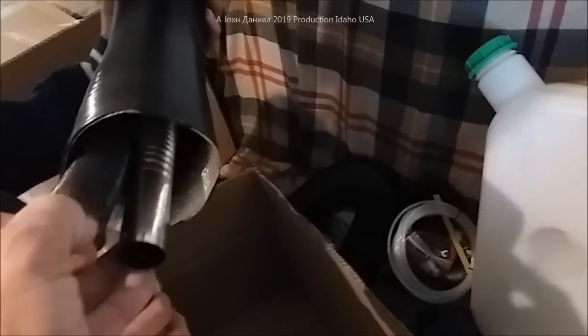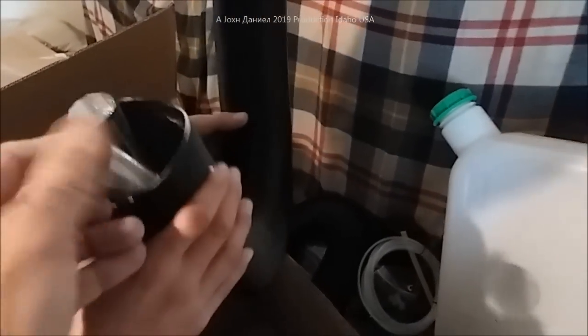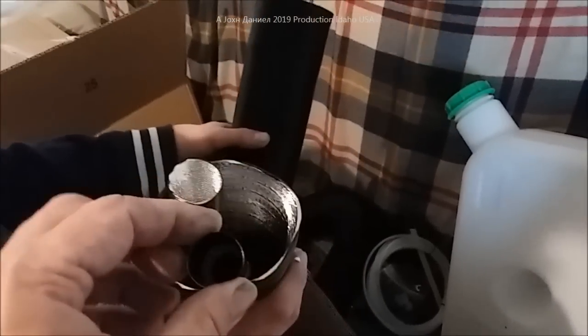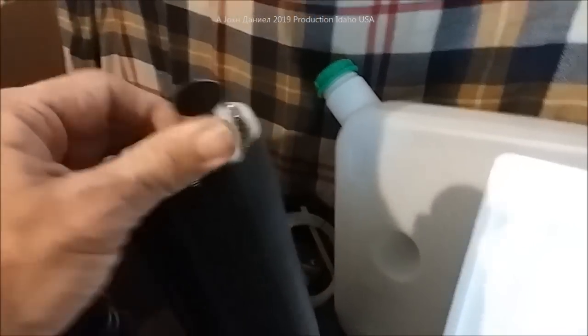In here is your intake and also your exhaust. We'll have to straighten that out to pull them out - that's how they ship it. Gauge-wise I'd say this is about 29 gauge, probably almost 0.5 millimeter. That's pretty strong - pretty good stainless steel too. And here is your mounting plate that'll go underneath your heating unit.